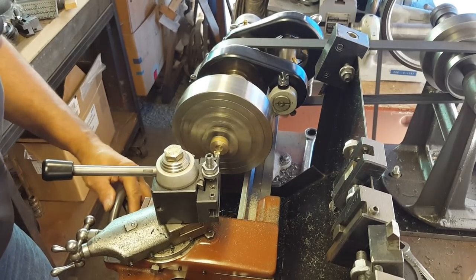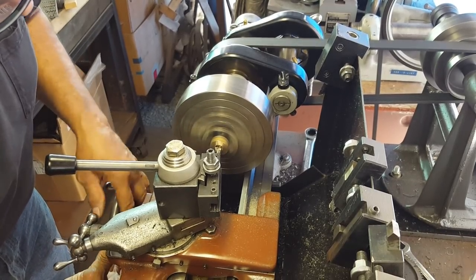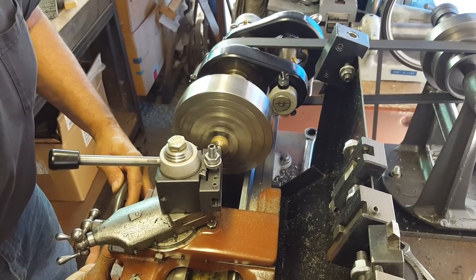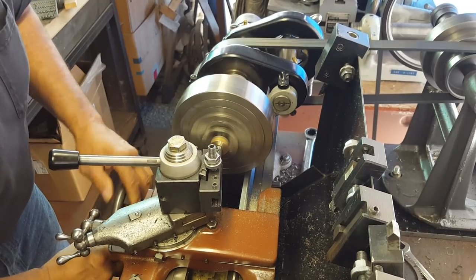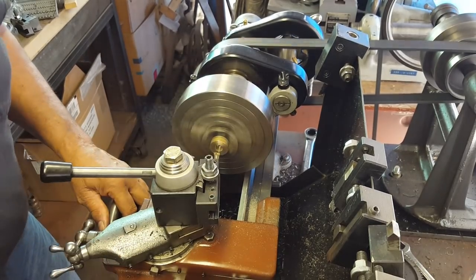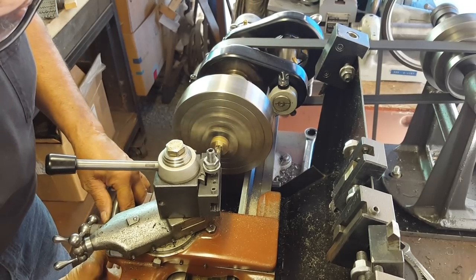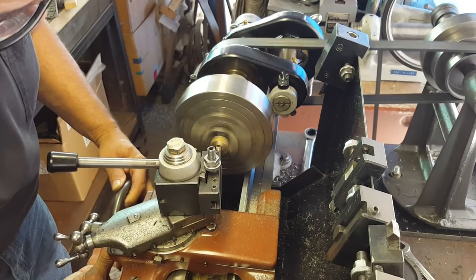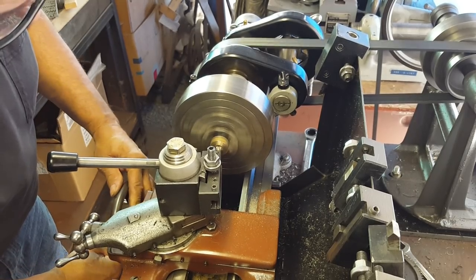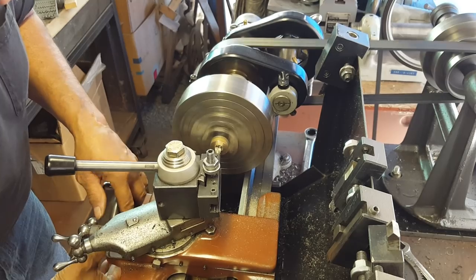Of course, now that I've come back from Randy's and we wound up cutting my lead screws for my mill, there's no way that you could stand here and feed those cuts that he did on his machine because the chips were just like scalding hot. And to get the finish on there obviously you can't control that either if you're doing it by hand. But this being such a small part - most of my jobs are small - I'm just doing some cleanup passes here, taking about maybe three or four thousandths at a time.